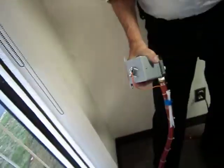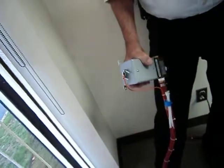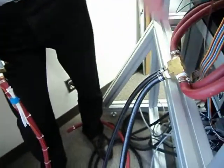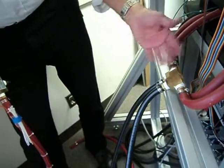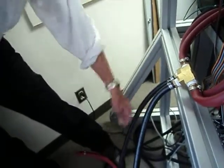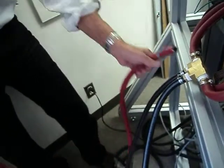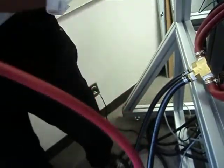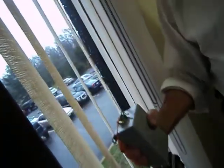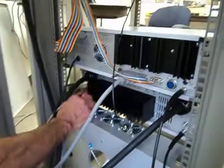With a water chiller, the supply out of the chiller goes into one of the hoses. Water flow through the coils has no direction — it doesn't care which way you put it in. But the switch does care, so the return coming out of the coils must connect to the flow switch on this line. This would be the input, water coming out of the coils, down and out to the drain. This would be mounted on the wall, and your connector here is this little black one that connects to the controller.